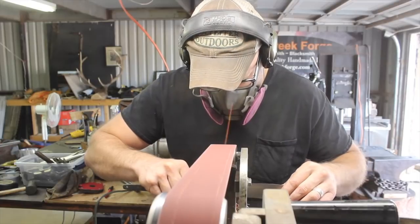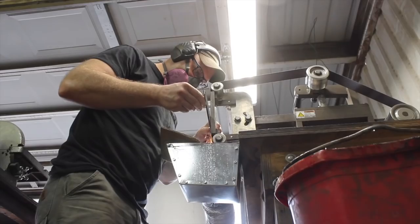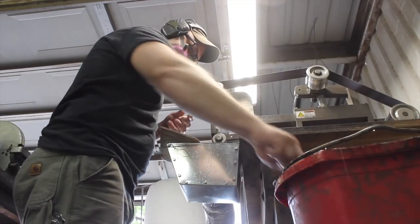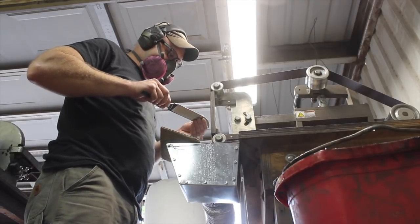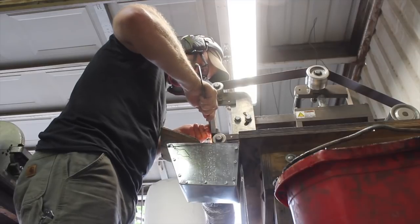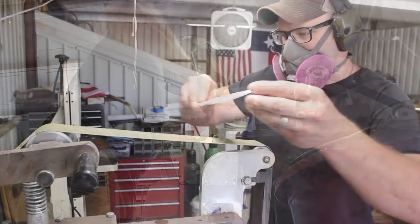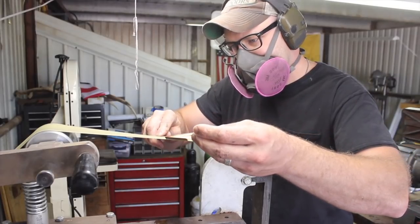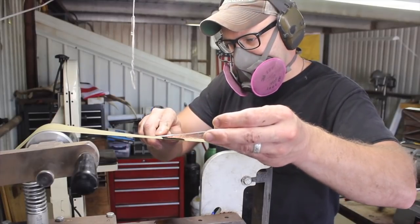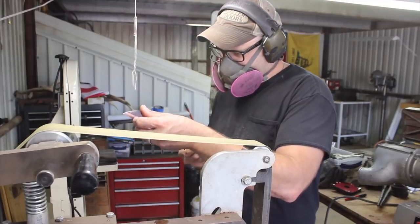Obviously the goal is to grind a consistent thickness down the center line of that blade. As I mentioned in the previous installment, I don't have a line down the center to grind to because there's really no way to do that efficiently when you have a blade with a forged distal taper. I suppose you could flatten the ricasso area and make the blade stable on that small surface, but it's really not worth the trouble. So just keeping an eye on that and grinding down to a consistent thickness — I grind it down to 25 thousandths and now down to about 10 thousandths with the slack belt.